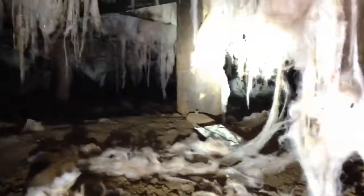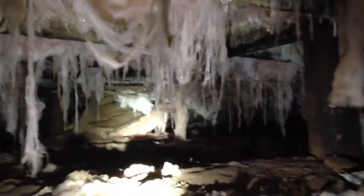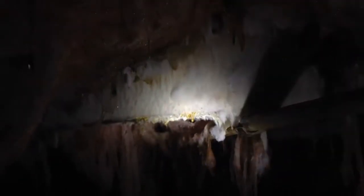Can't really tell where it's coming from at all. I'm just in the very beginning of the house where the cubbyhole is, but I'm about to go further down to where the washer and dryer area are. Alright, so I'm up under the guest bedroom right now and you can see that the floor joists are still really wet. That's all mold on the floor joists — it's like that pretty much up under the entire house.